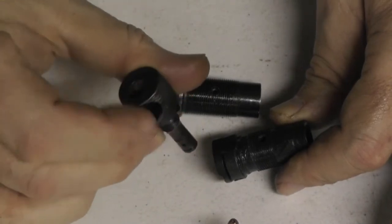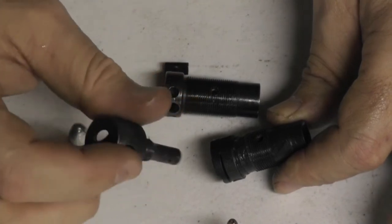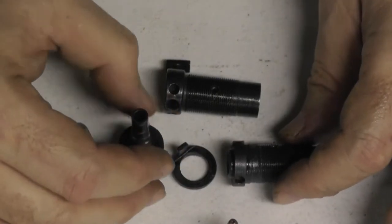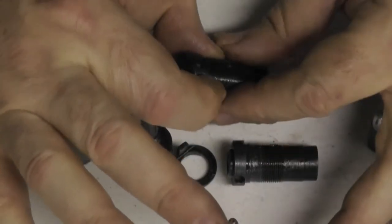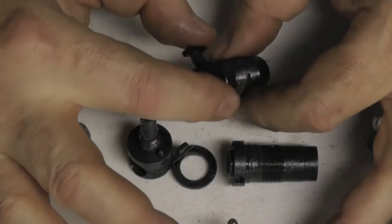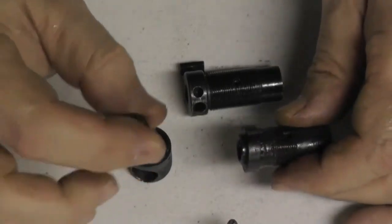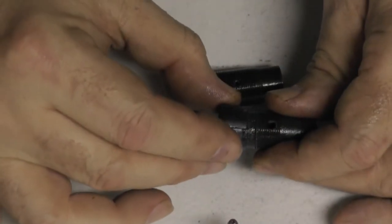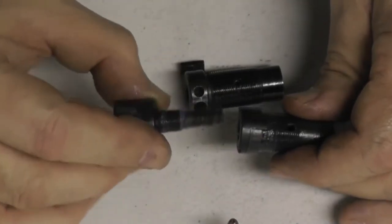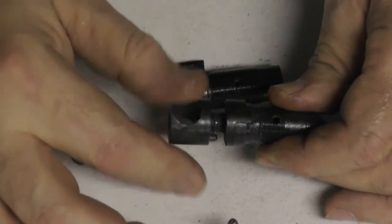Unlike the old one which has three holes in the body, this new one has three holes right here on the outer sleeve, and those holes correspond to markings on the front — one, two, three — for small, medium, and large, just like the old one had markings for small, medium, and large gas openings. So this body sits in the gun, the sleeve slips over, and then you screw this piece in. As you can see, everything's anti-seized — they've already had this in the gun.